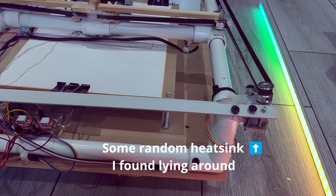As I said before, I over-volted the 5V motors to 12V, which means that they do heat up a bit, but the torque increases threefold. This shouldn't harm them, as they're fine up to 150 degrees Celsius — that's 302 degrees Fahrenheit for all you Americans. However, I'd still recommend strapping on a heatsink, as I've done here. Just make sure to put some thermal paste between the motor and the heatsink.